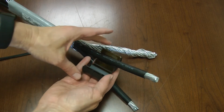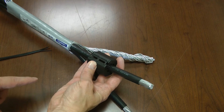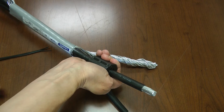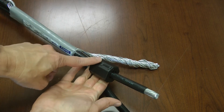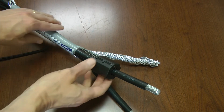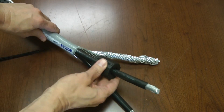The way I recommend doing it is you face the clasp toward you — it's just easier to work that way. You clamp the ferrite together tightly and then push on the actual clasp itself. You can tell when it seats properly. These ferrites fit a four-aught wire, which is typical for a 200 amp service feed, and they fit it very snug.